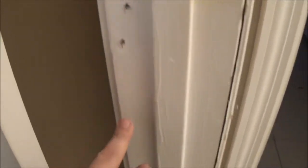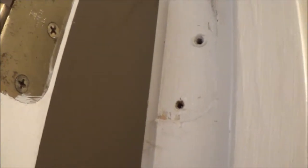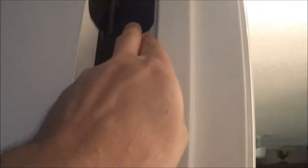So the original door that was on this house — this house didn't have any doors when she moved in. None. It originally had three hinges on it. This door has two, and of course you can see they're backwards, so we got to take these off. They're not the right height either. This door is sitting all the way on the floor and it's just lining up — we can't have that. Someone's had this problem with this one; it looks like they split it and they're screwing it in. It originally had three and someone put two on it.